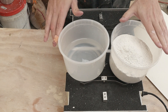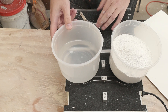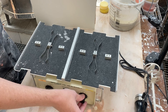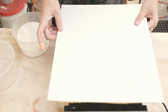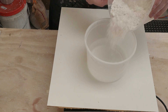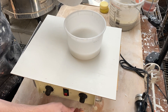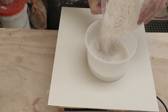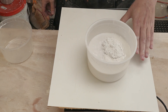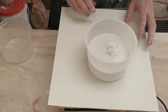Next up is mixing the plaster. I have my plaster all measured out here — both the plaster and the water. Last time I did this on the shaker table, I think I'll go ahead and do that again. I'm doing this moderately slow. Got a board here I'm just going to mix everything on. First up is slaking — I'm going to pour the dry onto the wet. There's actually an interesting question about whether to have it shake while it's slaking. Slaking basically just hydrates all the particles whereas mixing them actually causes the chemical reaction to happen or accelerates it. Magic plaster chemistry. I'll go ahead and let it shake this time and see what happens, letting it sit for three and a half minutes.